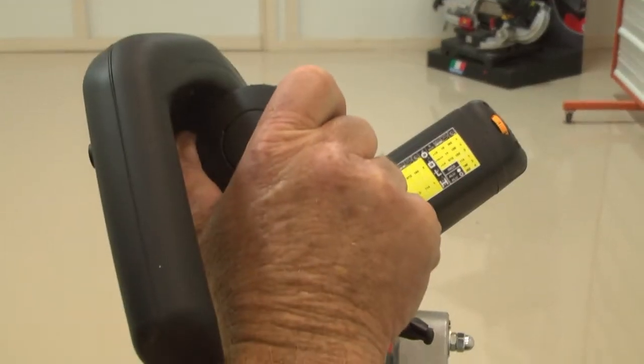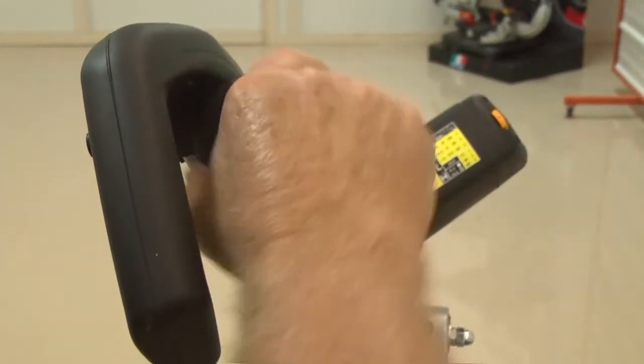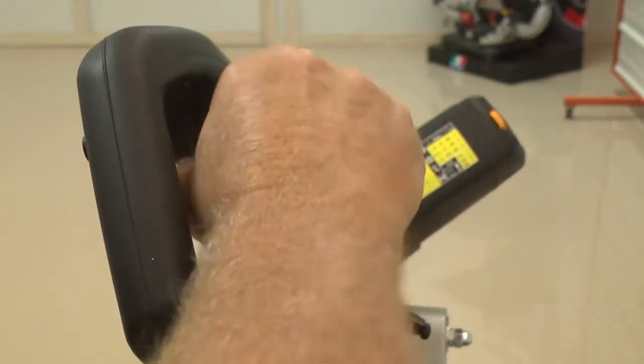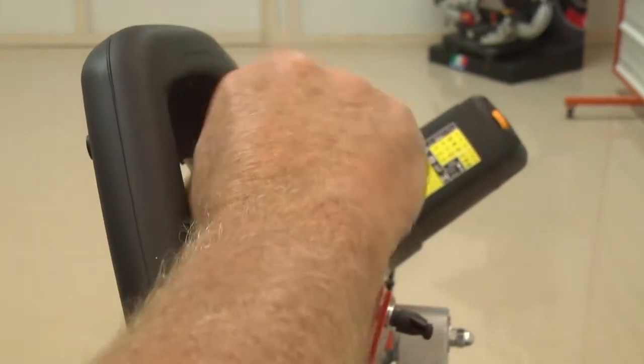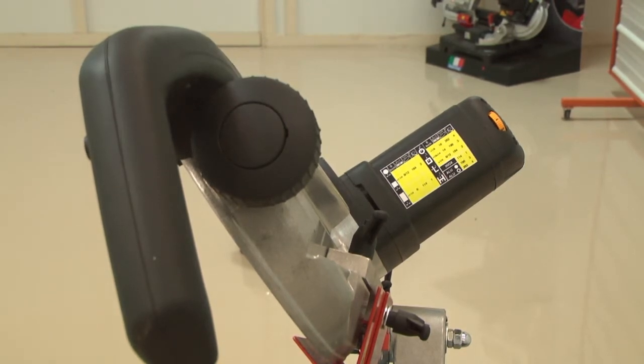The clutched blade tension knob is used to loosen the blade. Tension is removed from the blade when the tension knob is turned counterclockwise. Twist the clutch tension knob counterclockwise, grabbing the outside part of the knob where the ridges are located. This is easily accomplished by using the thumb and first two fingers. Only the ridged end cap of the tension knob assembly needs to be turned.